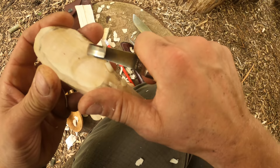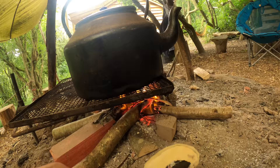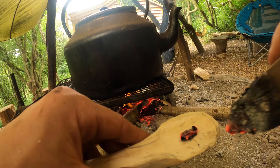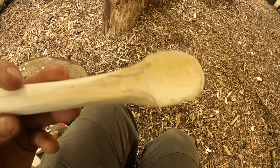Take your time — it's this ridge in the middle that catches a lot of people out. Go back to your start position, do the same again, be patient but focus on trying to remove that ridge in the middle. If you didn't have access to a crook knife and you wanted to use a primitive method, you could go ahead and grab a small ember out of the fire, break off that ember into the bottom of your bowl, hold that ember down in the bottom of the bowl, and literally start to burn and blow the ember all the way around — burning a bowl into the bottom, known as the burn bowl technique. Then you'd get a stone or a piece of flint and scrape out the inside.